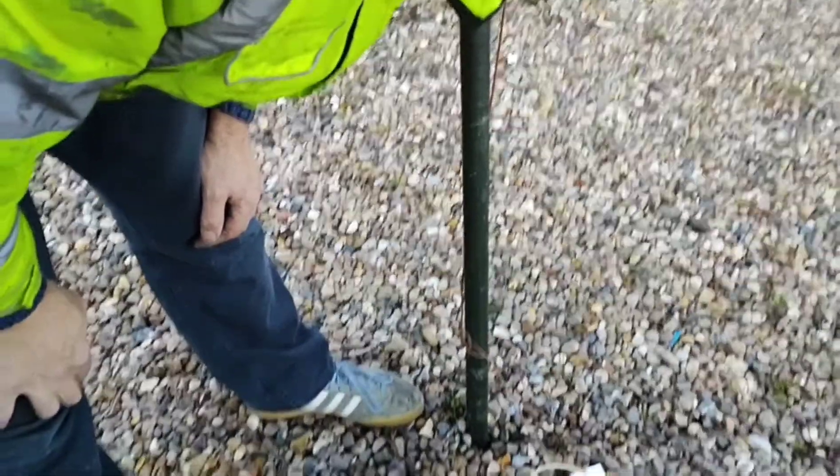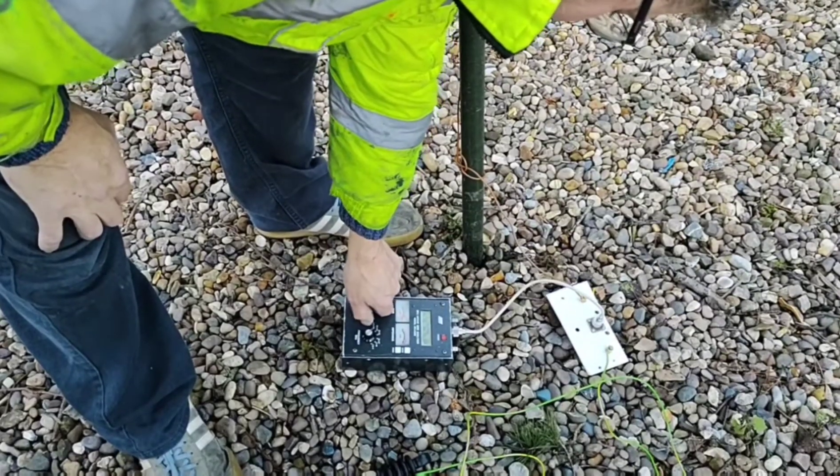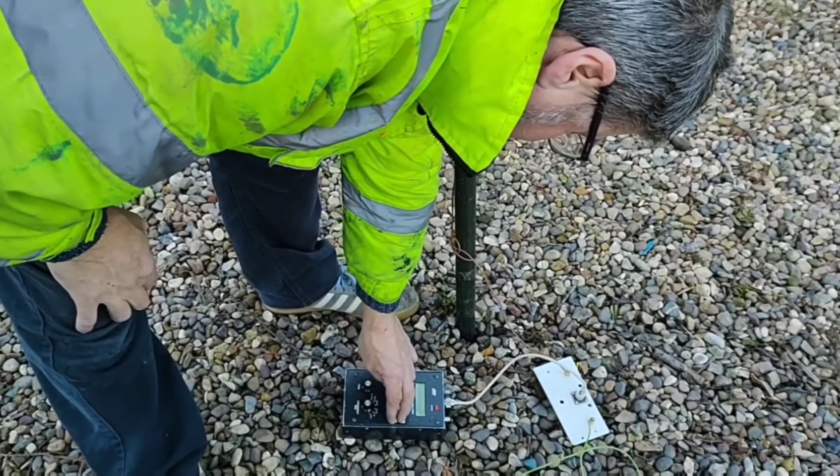What's that on frequency? 1.750 SWR at 3.745 MHz. But what we'll do — we'll just tune for resonance, see where the resonant point is.